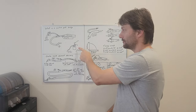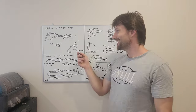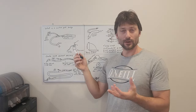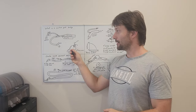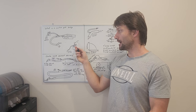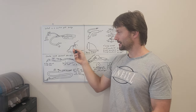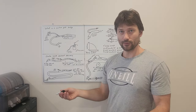A way you could get around that would be to take a five-gallon bucket and stick a bilge pump in the top of it. If your bilge pump is a one inch pump and you run a one inch hose into the bucket, this pump pumps water out. You have a little screen around your intake and now you have a bucket full of sand and gravel — off you go.